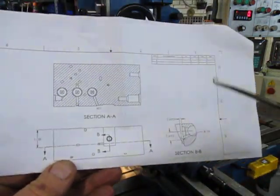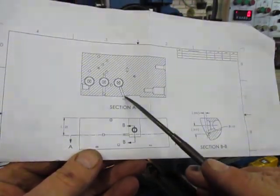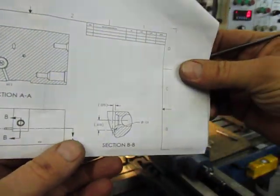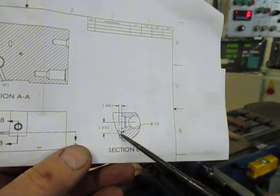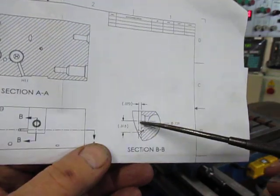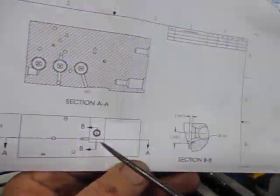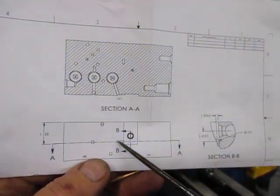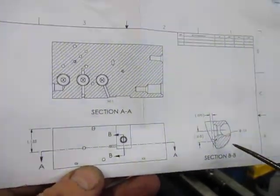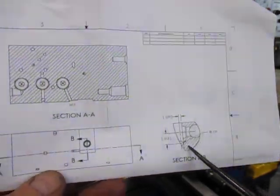The drawing's been sent through on this hydraulic arrangement. They want me to cut a groove from that orifice there across to that flat section. If we look at the detail, it's going to be ball-nosed, 70 thou deep, and it needs to be 0.315 from the centre of that hole. I've already lined it up, set it up, and I've started to groove that. I'm using a 1/8th ball nose as they've called for — 0.125 or 3 millimetre — that's fine.